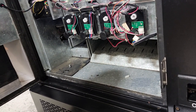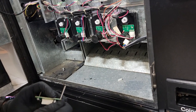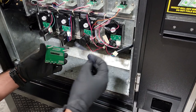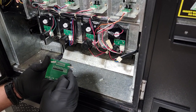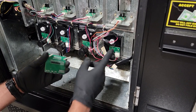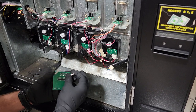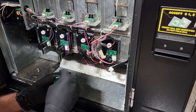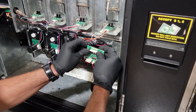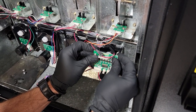Then we're going to take the new six channel board and put the screws in it. You're going to want to make sure that you take your plastic backing and put that back on. If not, it could touch your components and short out your board — it's very important that it goes back on. You're going to put your spacers on, get the wires out of the way, and put your screws back into the holes — just the two right on the top there.